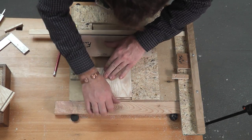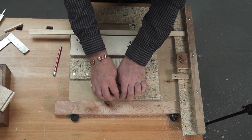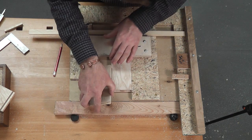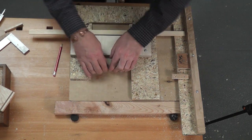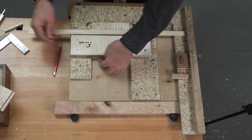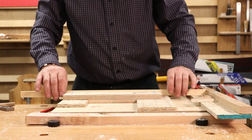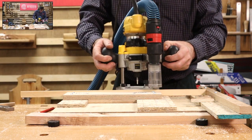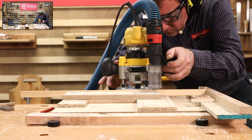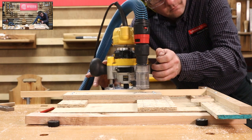Again, get rid of those fibres that are going to get trapped in this front edge. Got to get them out of the way. That one's tighter, so let's do that first, that's better. All the way down, again I'm checking the front edge, things are coming. I can feel on the back edge where we've got that this is nice and flush. 5mm spacer. Back to there. We come down. We come across.